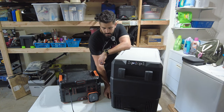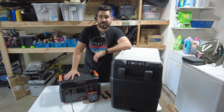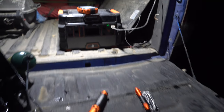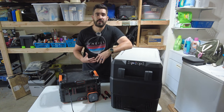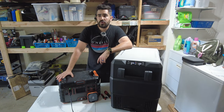The power station itself was great. I used it to power and charge equipment in the back of the truck. My dad and I would cook out of the tailgate — I have a Walmart LED light that hangs in the rack using a wall outlet, so I plugged it into the power station's AC outlet. That's not the most efficient way since it runs the inverter, so it's better to use the 12-volt cigarette lighter or USB. We also used it in the back of the truck to charge phones, Apple Watches, and whatever else we needed.